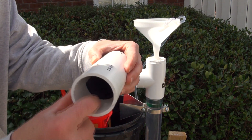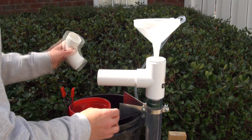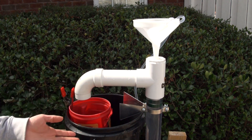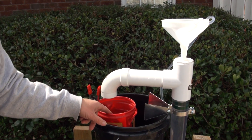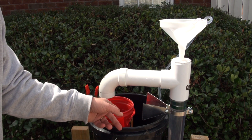You're gonna have a little bit of a space in here, then your mat. I just look at it, put it in the unit, put my other piece on top. Depending on the amount of concentrates you're running, I use a coffee can, but you can let it drop directly into a five-gallon bucket. Today I'm behind my house — it's pretty windy. I'm going to run concentrates from the Viper Pro flare run — we ran about eight tons of material and have about a gallon and a quarter to a gallon and a half of concentrates, screened down to a quarter inch.